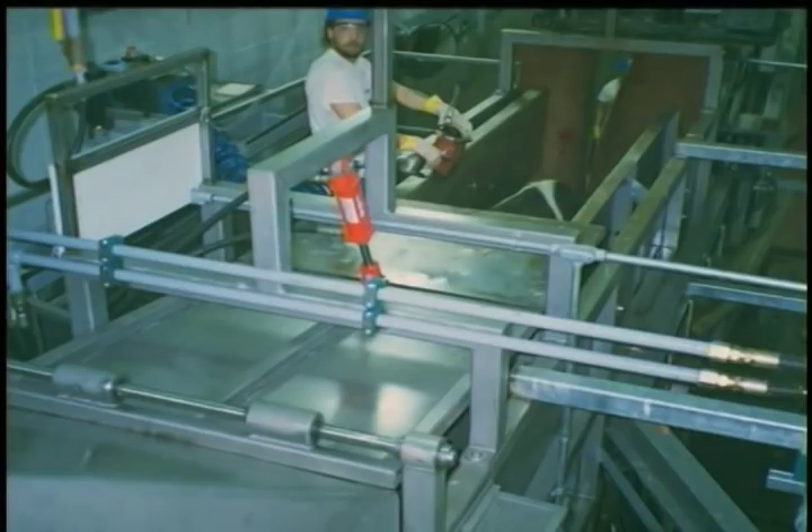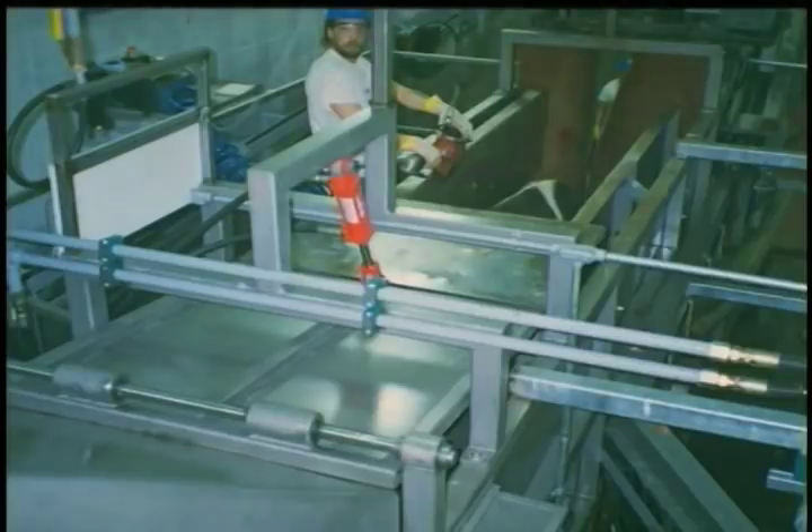If the animals are throwing a great big fit it's going to make them hard to stun. Somebody decided to put a hydraulic device on there and shove the animal down — that's the wrong approach. What they had done wrong was make the hold-down rack too short. The plant was calling me saying they were having all these problems, and I asked how long the hold-down rack was — it was two feet too short. So I asked them to lengthen it. I have gone into plants and just used cardboard. On the very first system I ever worked on we made the mistake of making it too short, thinking we could stun them quicker. So I got some cardboard and laid it over the top of the system, and lo and behold it calmed those cattle right down. That's using behavior to control them rather than force.